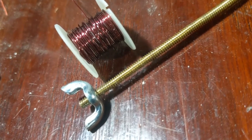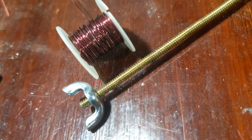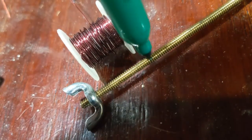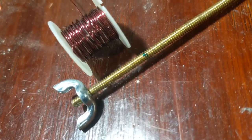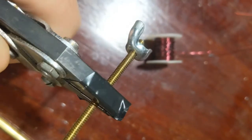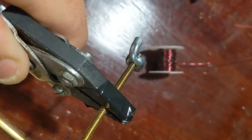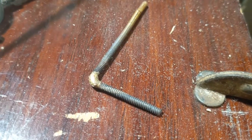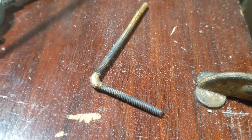Now I'm going to make a measurement to see where I'm going to put the 90-degree bend in my threaded rod to accommodate the spool. I've got some coated wire here and I'm just going to make a little mark on that rod so I know where to start making that bend. I'm gripping the threaded rod just above where the mark is and bending upward at 90 degrees — that did not go so well. As soon as I went to make the bend, it snapped the rod.